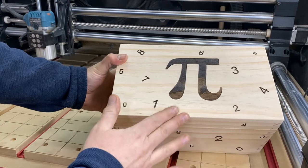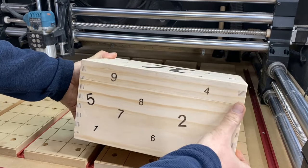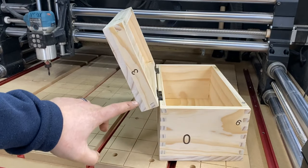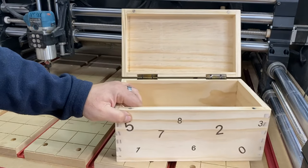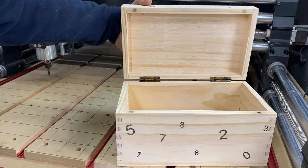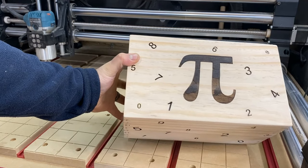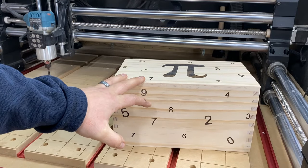This is the state of the box now. I cut the lid off over at the table saw and flushed up all my box joints. Then I added some 105-degree stay-open hinges - that way you can leave the lid open and it will stay. On the base and on the lid I put some magnets, which just helps the lid stay closed and kind of adds another dimension to this box. I'm loving the way this is coming together. I'm going to add my favorite stain, which is Early American, and I will bring you guys back in when that is done.